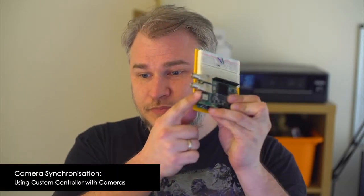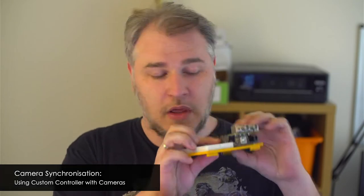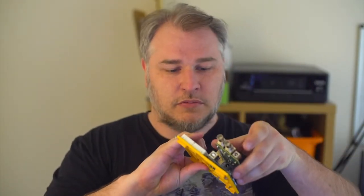And it all came down to start off with the Blackmagic Arduino Shield. And this is it here. It's sitting on top of my Arduino Uno. And the Arduino Uno isn't the board that we used for the final thing, but we did a lot of prototyping on that. So inside of the housing, we used this little Nano. And that Nano was quite good for the form factor that we're going for. However, the kind of breadboard attached to the Arduino Uno is very primary to what we do, and the shield fits directly on top of that with all the pins, and it works quite well. And this was specifically developed by Blackmagic to work with the SDK available for the cameras.